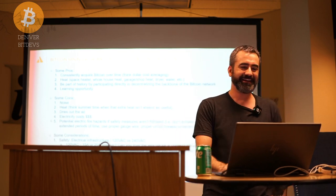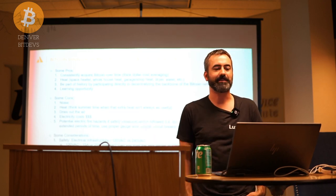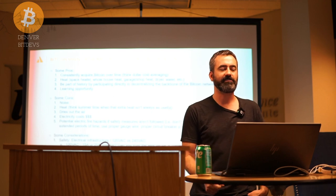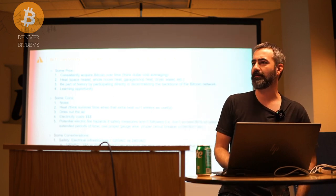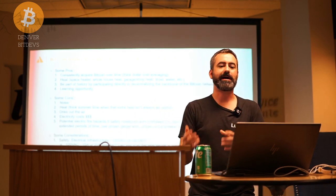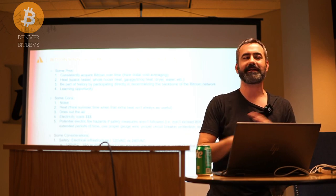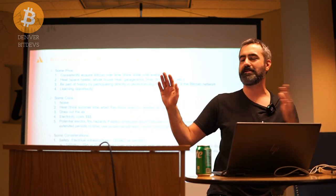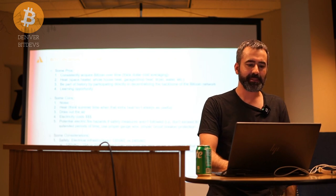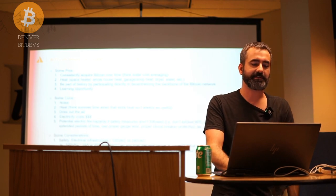Especially this last week. And then also, there's safety hazards, right? Fire hazards. These things have been known to light on fire. Personally, if you're underclocking, I think you're very safe in general, but you still have to pay attention to your own home's electrical infrastructure, the ampacity or amp capacity of your wiring, your circuit breakers, all those things. And that's one reason I want to keep this under 1,000 watts, because I don't have any idea about this place's electric infrastructure, but I know that's a pretty safe value for continuous operation for the amount of time that we're going to be here. So yeah, safety and an economic justification are some other considerations to think about.